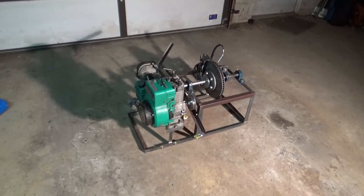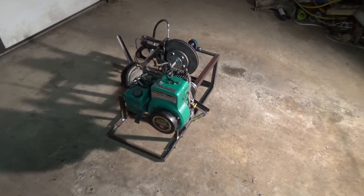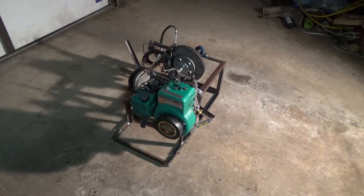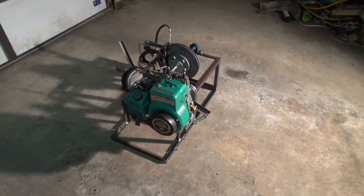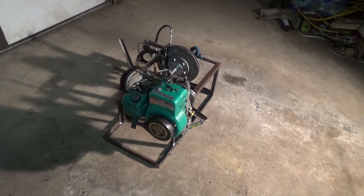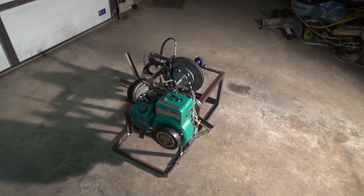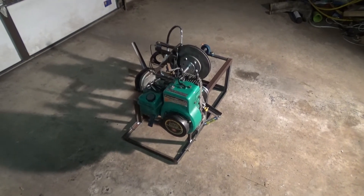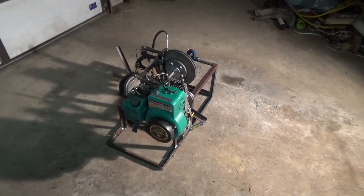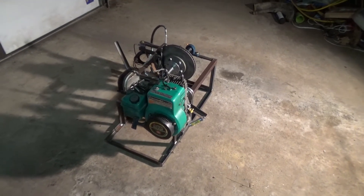It's actually going to be this engine. I've got a 5 horse Kawasaki, and I'm going to do it. I've also got an 8 horse Briggs in the back garage I'm going to apply it to as well, to make sure it's a universal fit. But during figuring out the code, I had in the back of my head that I'm going to need a way to put the engine underneath a constant load so I can tune it in. I'm going to put a wide band air-fuel ratio sensor on it, and I'll need a consistent or variable load so I can tune the engine completely without it just free revving. Because you can tune an engine free revving, but it's going to run like crap if you don't tune it under load also.